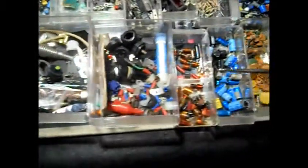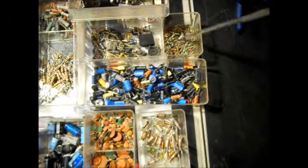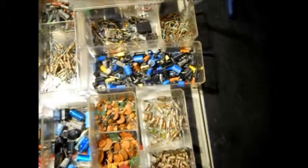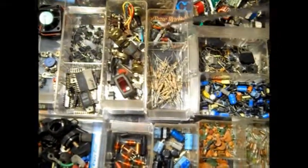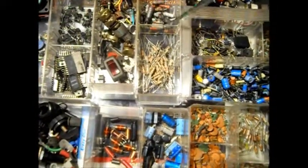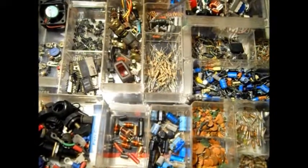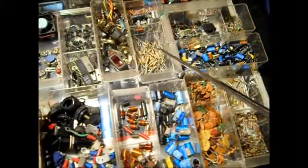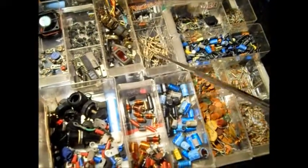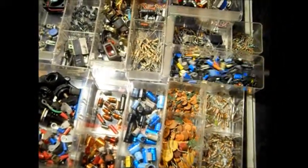Before I put it in the cabinet — like some of these resistors, these are really small, the kind you'd probably use on LED kits. But either way, you can always use the bigger ones. Here are some really big ones. Some of this old stuff — some of these resistors come out of older radios, maybe out of some tube-type equipment. Some of these are old-style resistors — they're just big. The bigger they are, the more wattage they handle. These are probably quarter-, half-watt. Don't quote me. They can go up to like this size.